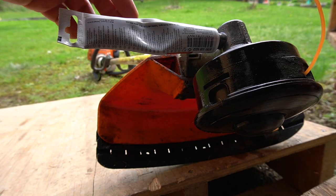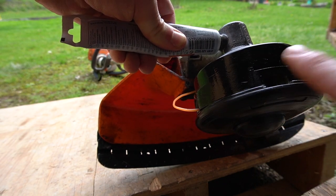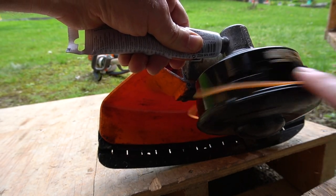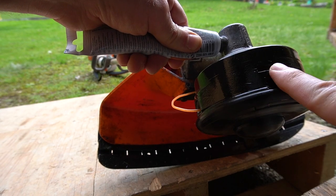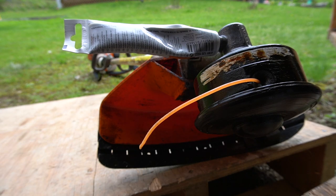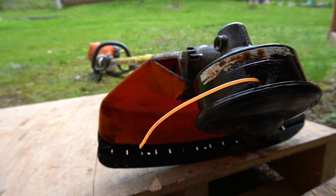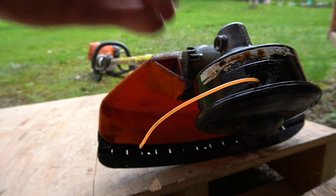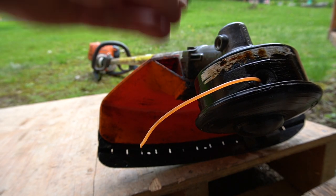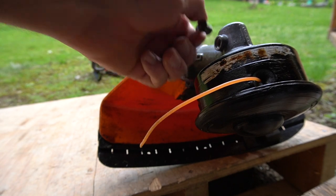You don't start and run it — you don't want to do that. What you want to do is just spin it by hand and squeeze it, so you get enough grease in there and it's all lubricated. Just like that — a simple, basic preventive maintenance. Then unscrew it, put the cap back, and you're good to go for another year, season, or month depending. Just don't forget to torque it back to specs, or at least make sure it's not loose.